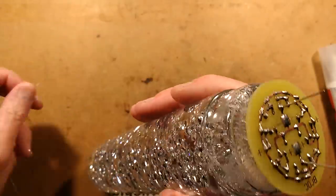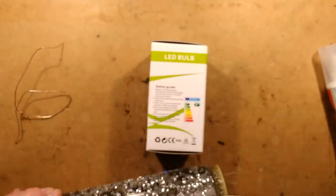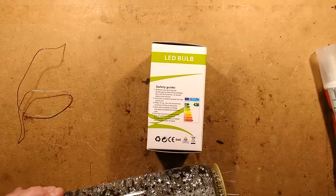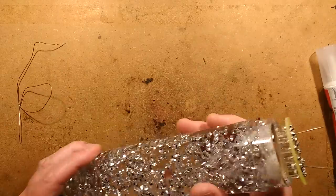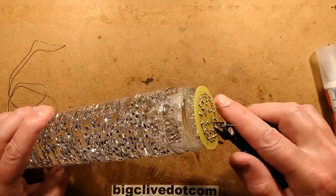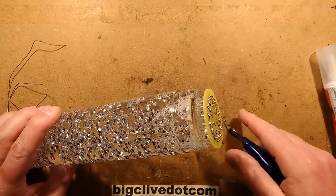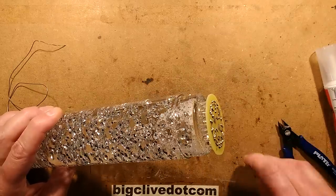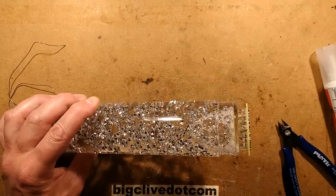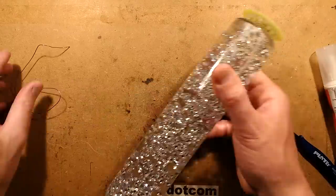So now the circuit board is fastened on, I'm going to crop those leads. Now, this is totally out of focus. Hold on, let me bring in something to focus on. Here we go, this is a nice box with text. And the text is important because of the way digital focus works. It basically compares adjacent pixels. It focuses right through the full range, or more or less the full range, and looks for the sharpest contrast in pixels. Because when you're out of focus, the blurring causes a soft contrast, but when you're in focus, it causes a sharp contrast, and that's how it detects.